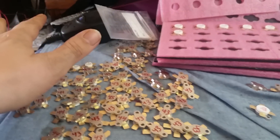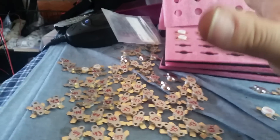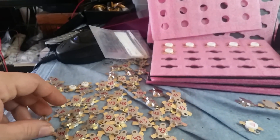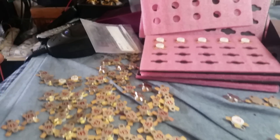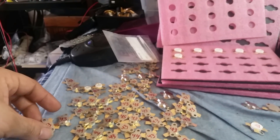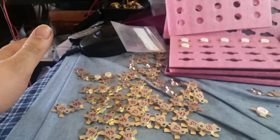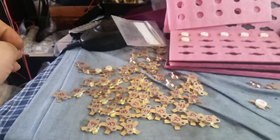You want those transistors to have the same characteristics. For an AB biased amplifier, I make sure I'm using the same number and same cut-on voltage. All of these transistors I just matched here in the last 30 minutes all have the same exact cut-on voltage because they're so close in characteristics. You might go through five or six more just to get ones that are the same in characteristic — that's why there's an extra fee in the cost for getting these matched like this.